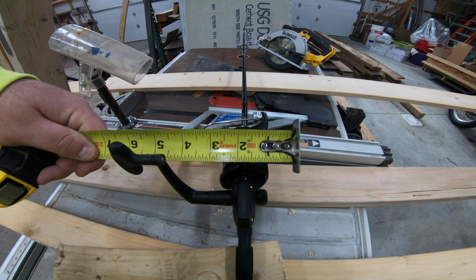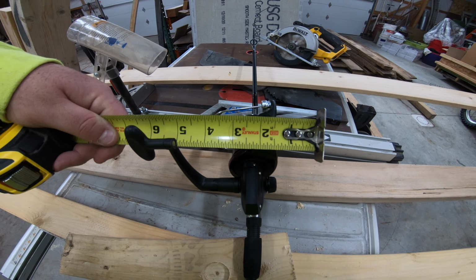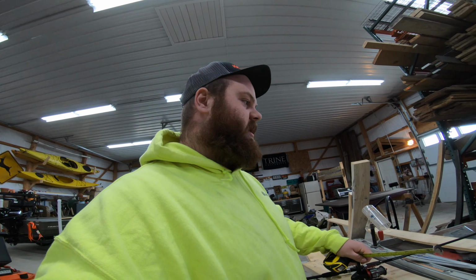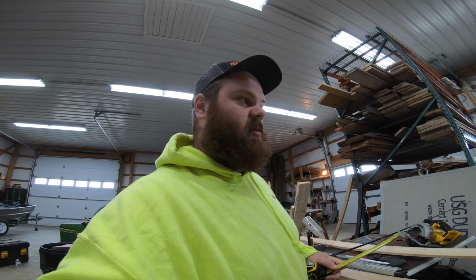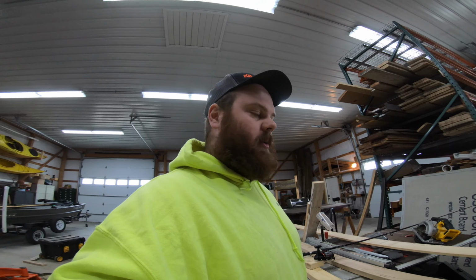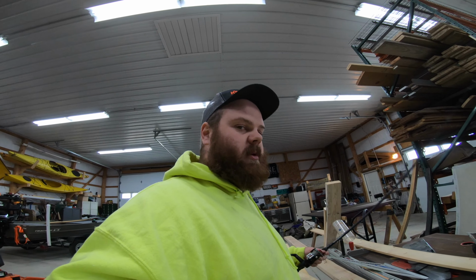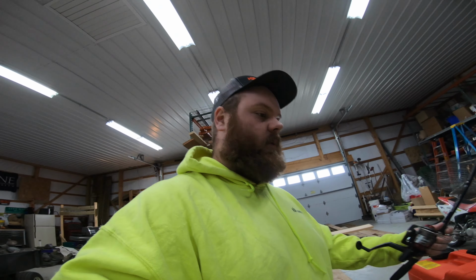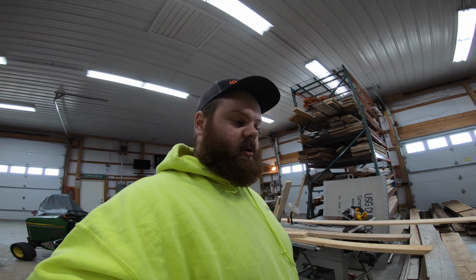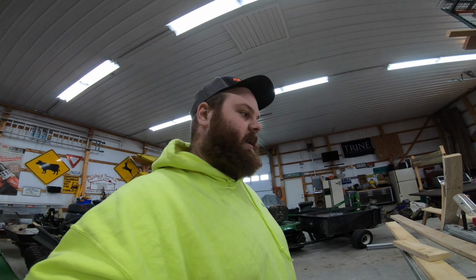Maybe a touch over. So what we're going to do is space these rods out at 7 inches. And that way each side of the pole has about a half inch of gap. And so none of these poles should be hitting or banging up next to each other. And that should be perfect for the reels. Some of my reels that are even larger for some of my ocean fishing will fit in there, maybe a little bit tight, but should be just fine, 7 inches. You could do smaller if you want, or if you just have rods and you don't have reels, you could even do them 3 inches on center, 2 inches on center, something really tight and packed in there.